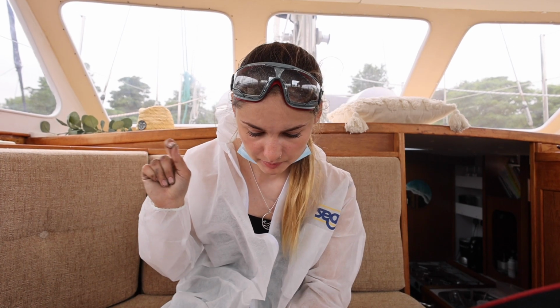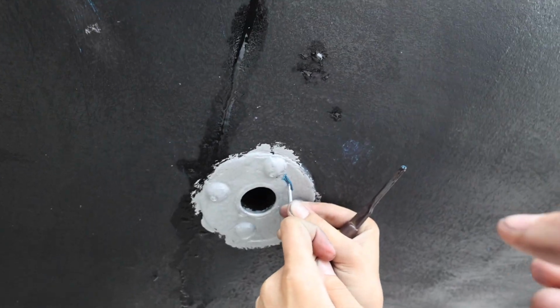We're going around roughing up each Seacock to see the colour of the metal underneath it. If it's golden, it's fine. If it's pink, it's not. Annoyingly, I only just realised we were meant to do this today. So Zach went around yesterday and primered all of them. Whoops. Although we went and scratched up the skin fittings and they were gold. That's gold. Oh, it's gold.